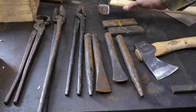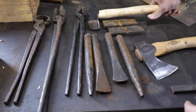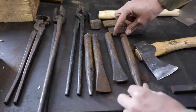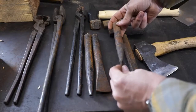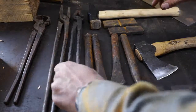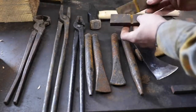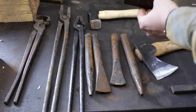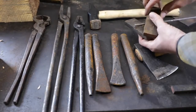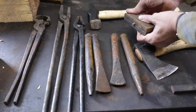Regarding tools, I don't have a lot of stuff — I'm just starting to put things together. I got a new hammer; I think this is a French pattern hammer. I haven't used it yet and I'm excited to try that out today. These are tools that I've built myself — these are for punching holes, and this is a walking chisel that I use to split and cut steel. I've got some universal tongs here; these two I picked up at garage sales and these I purchased from the Whitlocks family. And then I built this here — a little die for making rivets. We'll need to make two small rivets to join the uprights together. These fit in here and I can clamp them in the vise and then round those heads off — works pretty good for making rivets.